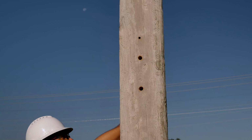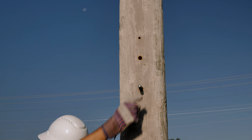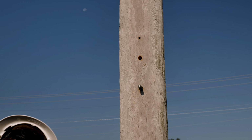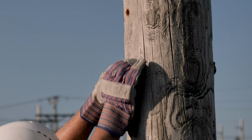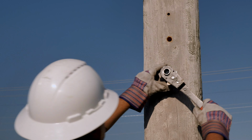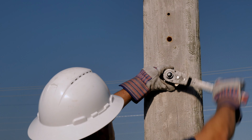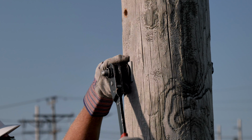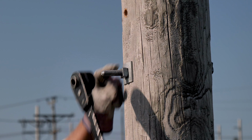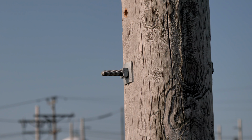This is a demonstration of a typical pole line hardware installation that serves as the backbone for communication line construction. The lineman installs 2 washers and a bolt sized appropriately to allow for the pole diameter and attachment clamp. In this case, a 5/8" machine bolt with 2 washers. A nut holds the bolt and washers in place. If needed, a longer bolt can be substituted, and the end can be cut off.